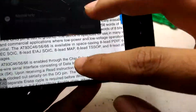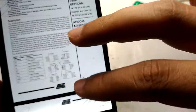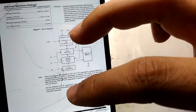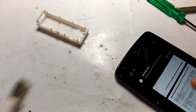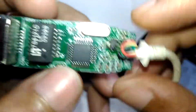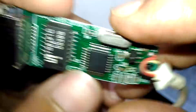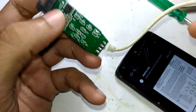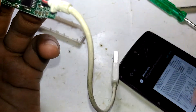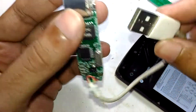You can check the pin out — serial data, clock, and everything like that — as well as the internal block diagram for that chip. So that's a serial EEPROM memory right there. There is also a crystal — that's a 25 megahertz crystal. And then there's the unknown main chip with no markings on it. So that's basically what's inside a USB to LAN converter.